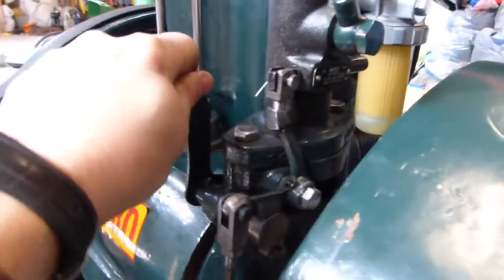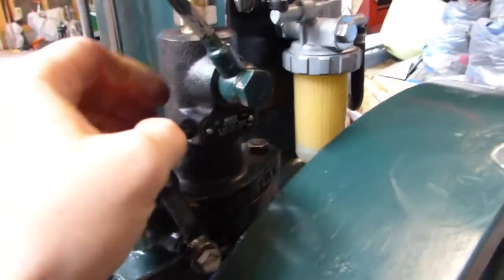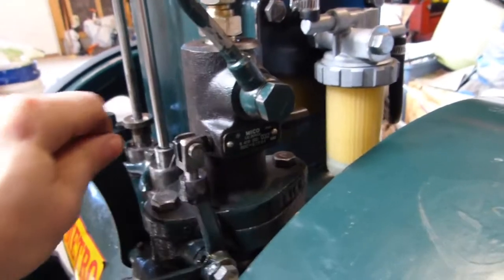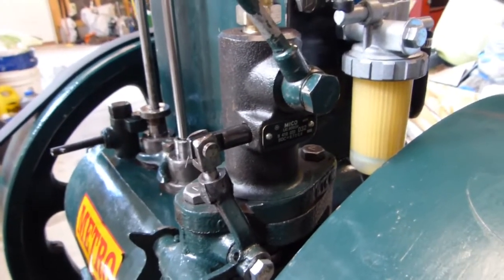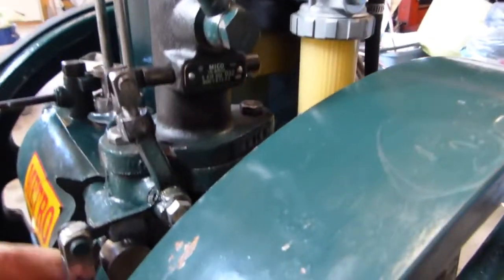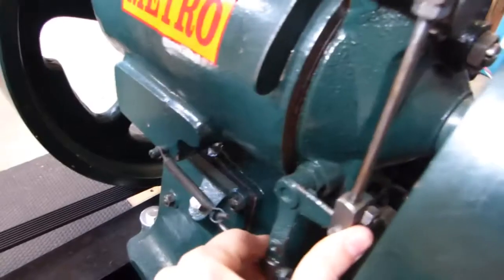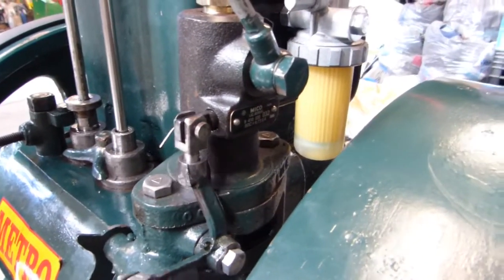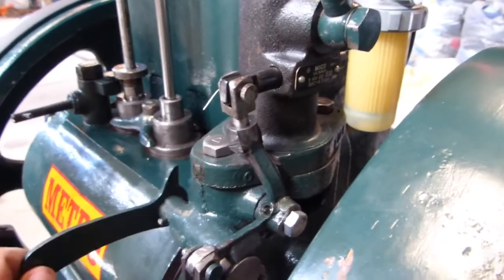This lever over here is actually the shutoff. So when this is down, it lets the fuel injection rack push whatever it needs to maintain RPM. Right now, that's completely open, because the engine's running at zero speed, so that's as much power per stroke as you can get. Then the governor inside, as the engine's running, adjusts that against the spring, changing the amount of fuel going into the engine to keep its speed maintained. But for right now, that's off.